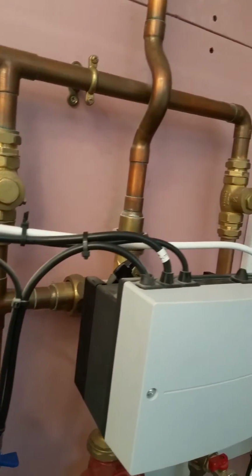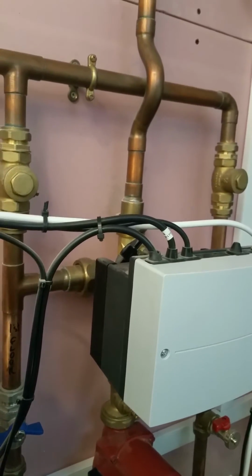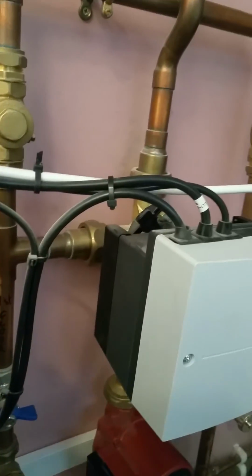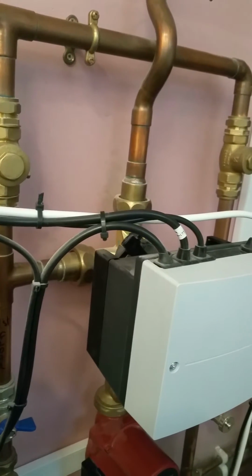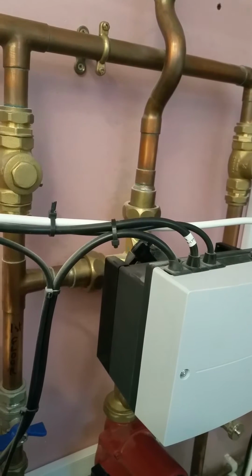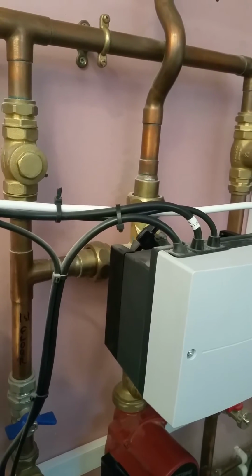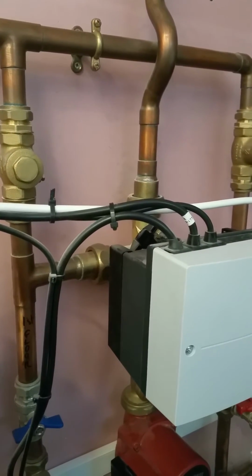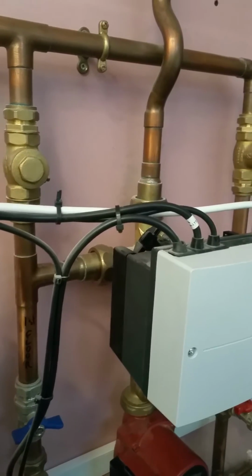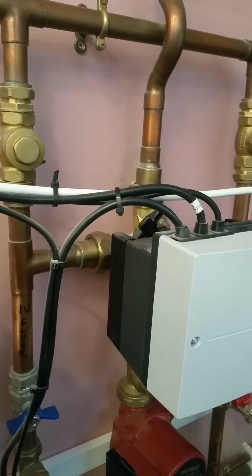Now this is the bit where my examiner has made me upset, because just after I'd ordered all the bits and put this all together, he started talking about authority. And if you look around here, I've got 1-inch valves, and really these should probably be 1/2 inch. What we've learnt recently on the forum is that we need to have the flow rate at a certain range through a valve for the valve to gain authority, and the 1-inch valve can handle very high flow rates, and I haven't got very high flow rates, so I'm going to have very poor authority on that valve. I might actually elect to replace those at my cost. The units on top are the same, it's just the back body, and they're not that expensive, so out of personal pride I'll probably end up buying a pair of those and coming back and fitting them.